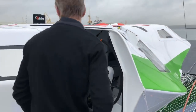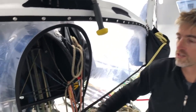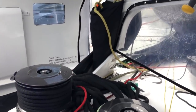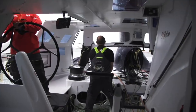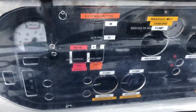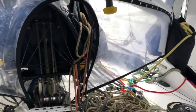Full control comes from the inside, because at this sort of speed we spend 99 percent of the time inside. Most of the control when we are not maneuvering or changing sails happens here. We have the conventional part with all the winches and rope areas coming from the sails to trim or change them, and then for the foils and the mast rotation it comes with hydraulics. We have two hydraulic pumps, everything driven by hand with the pedestals, and a hydraulic panel with electro-valves and manual valves to switch the different positions of the foils and rudders for flight control.